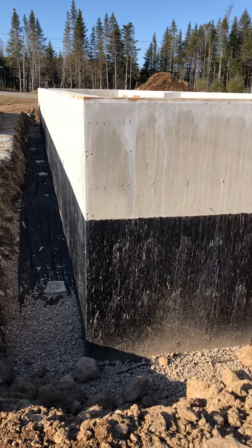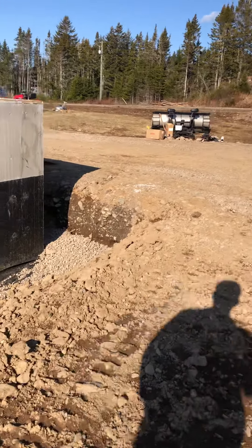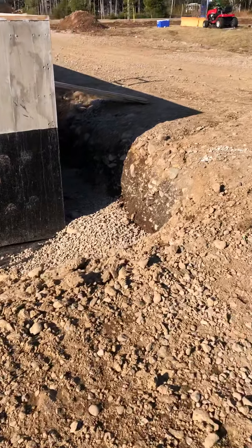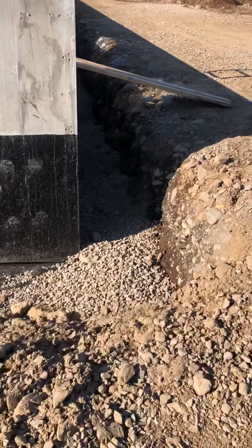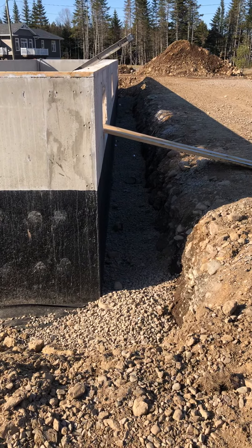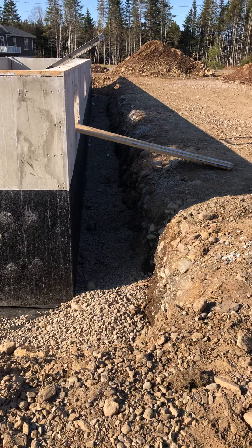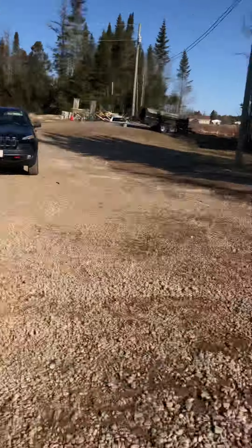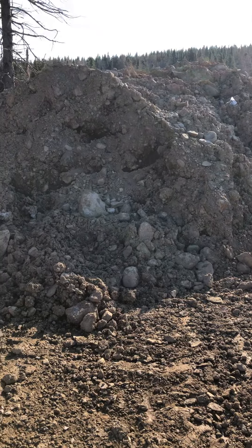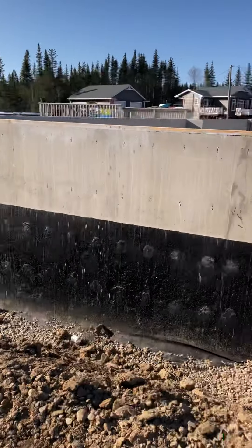But more often than not, it's water that comes from the sky and runs off the adjoining property and down into the ground. We put this clear rock down there that you see, so the water can get through. This is a challenge I sometimes see on job sites — that clear rock is not there and they've used existing dirt. If you look, there's the rock pile we're digging from, and there's the existing dirt — lots of earth and topsoil and sand in it. Water doesn't go through it well.